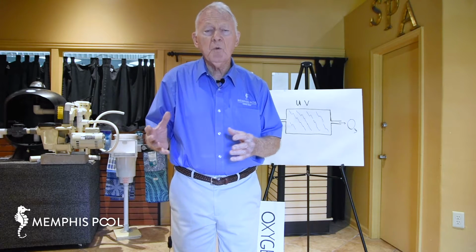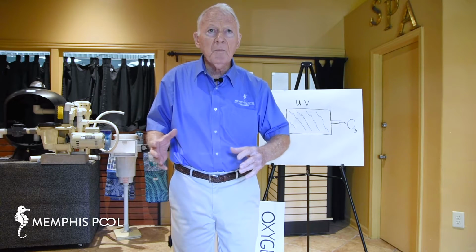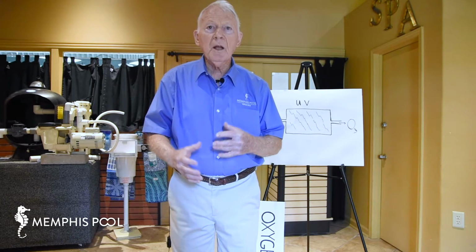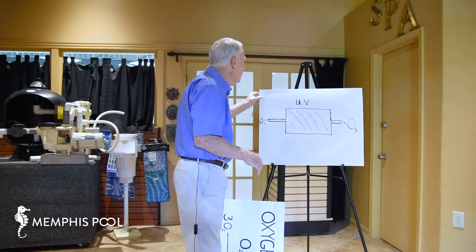As I said, you don't have to worry about it affecting the pH. You don't have to worry about overfeeding too much ozone because it just doesn't build up. So this is why the ozonator is running all the time to help with the sanitation process in the water.